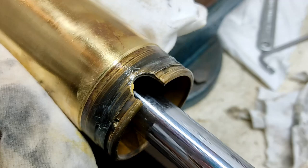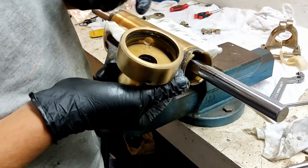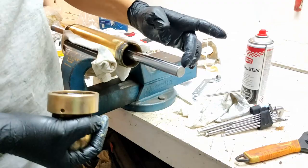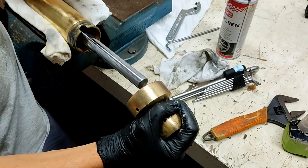It's fairly low risk, but the lip seal going around the ram shaft is another high risk one. Because if we nick that lip getting it on the ram, basically we can pull it all apart, start again, put a new lip seal in. Because if we nick that lip seal and cut it in any way, it's a rubbish bin job, because it will leak. We have a nice radius on the end of the ram shaft here, so that's good. So what we've got to do is, again, start from the bottom, engage it at the bottom, and gently roll the lip up and over this radius.